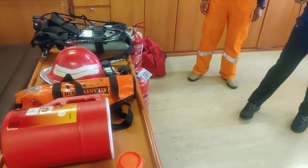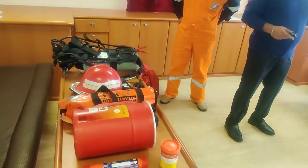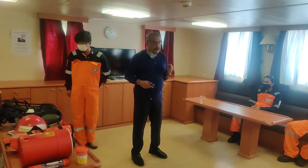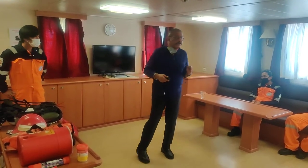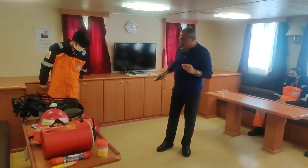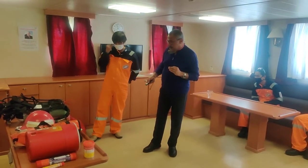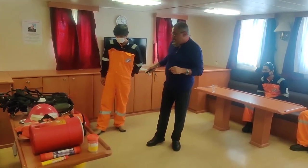First and foremost, what I want is that all these extinguishers to be color coded. What is the color code for DCP? Blue. For water, it's red. For foam, it's yellowish. Yellow. Beige or a little darker, beige or yellow. And for CO2 it is black. So what I want, all over here, all the color coding should take place. Like here it is yellow, this is white, is no good. I want the color coding to take place here, chief officer, third officer, okay? Black should be here.